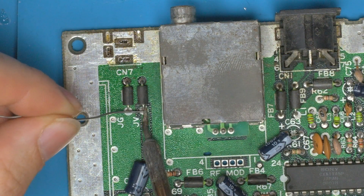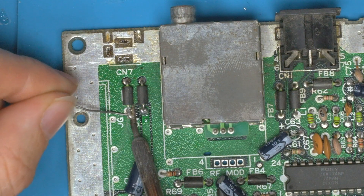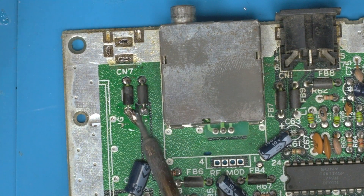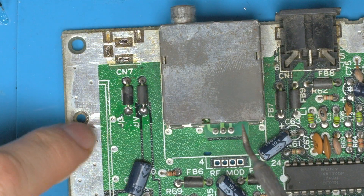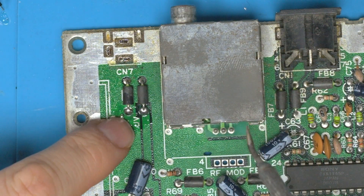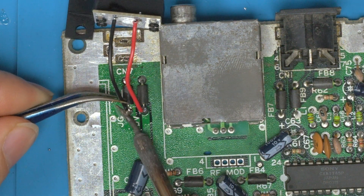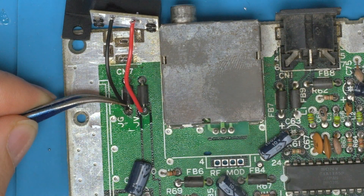We'll tack on from the bottom side — just make sure you've got the polarity the right way. Check your ground on your revision using a multimeter on continuity: go to the cage and test which one is ground if you're unsure. The ground pad takes significantly longer to warm up and flow because it's a large ground plane, so make sure you get a good connection. You can literally see which pad is ground going to it, but always measure to be sure — you don't want to solder this on backwards.